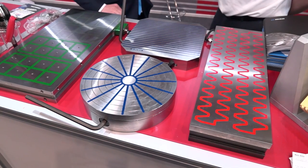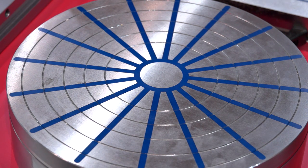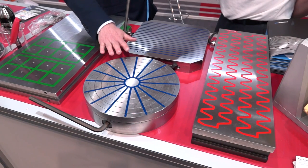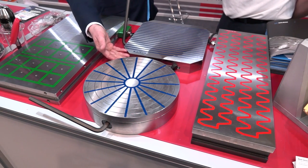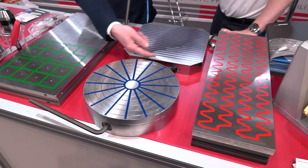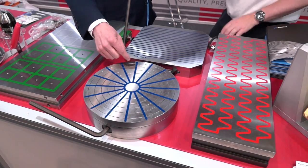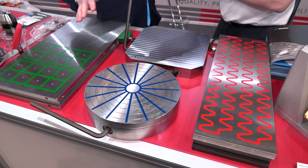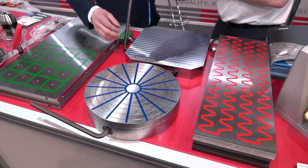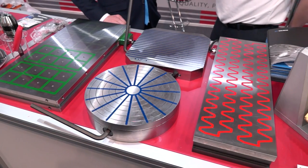That's a turning magnet called Neostar — customers have known it for years and you can see it on machines and in applications. Our solution is different because it has a solid steel top plate and a solid steel bottom, so cooling liquid doesn't get inside. If you need pockets machined into the magnet you can do that freely without worrying about damaging the top plate construction, and customers also add different auxiliary top plates for different fixtures.